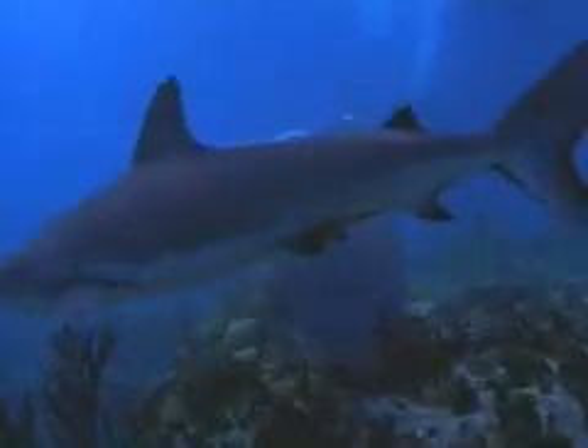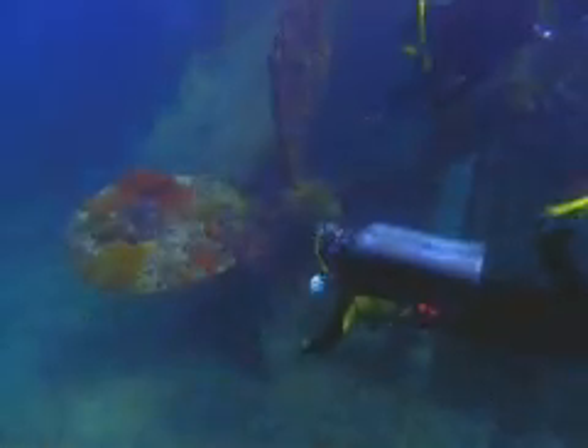CosmosWorks came into the picture when we realized the enormity of what we had bitten off with this project. This camera housing was going to be subject to 150 PSI, which is roughly the pressure at 300 feet. When you have parts that are as big as they are, something that moves 100 or 150 thousandths is a lot when you have all these little buttons that you're trying to actuate or control.